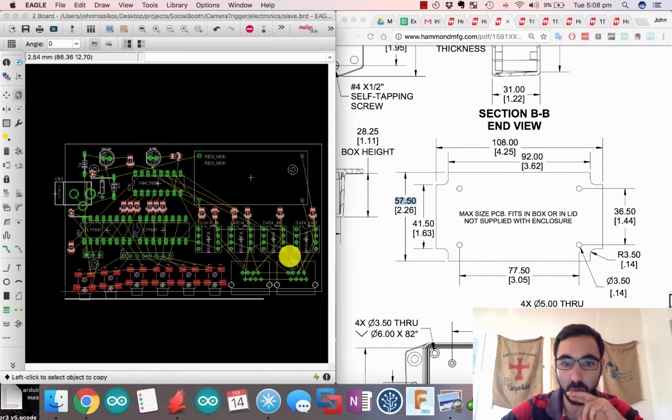Obviously I'm gonna need to move a couple things after. And I'm thinking I'll put the Ethernets on the side. So that's going to be a little bit of fun, trying to wriggle all that in. I'm being really cheeky again by using this large regulator that's an off-board piece. So one other potential saving that I could do is put all these surface mount resistors and caps on the opposite side of the board, and I could probably move away from these through hole chips, and that might be what I need to be able to move forward.